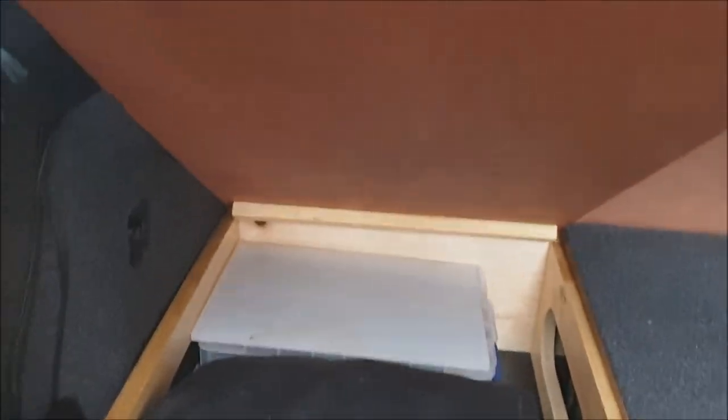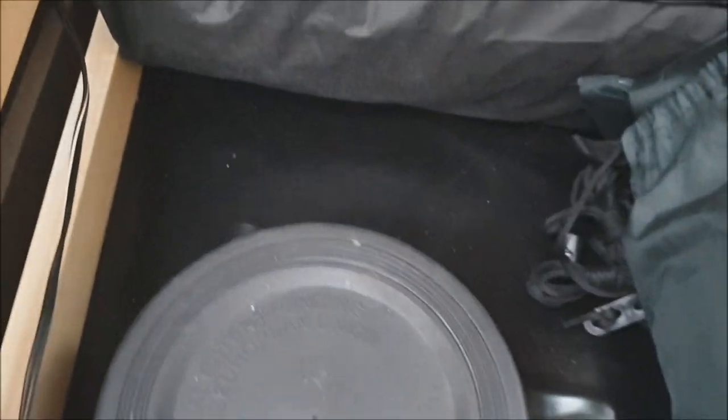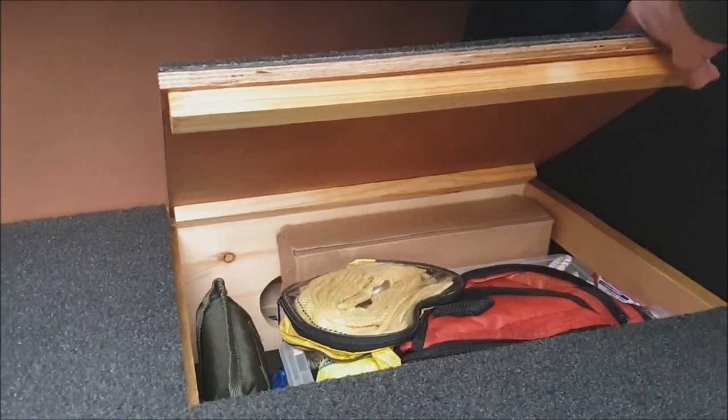This side is all one panel. That lifts for storage. The top is 12mm plywood and I've just put some wooden batons on there to stop it sliding around. The main unit is made up of planks with holes cut out to reduce the weight. The bottom is another piece of plywood and I've covered that with some rubber sheeting to stop things sliding in there. At the back, that's just another lift-up panel and that's got another storage compartment under there.